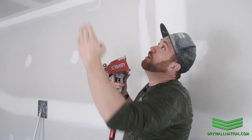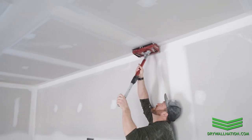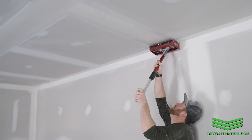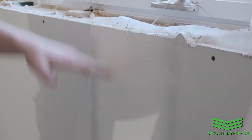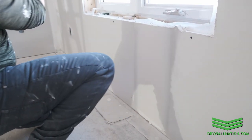Here's an example of what I was just talking about — there's a dust pocket right in the mud there. That's the dust being trapped between the mud and the joint, caused from pre-sanding. There's a little bit of dust on the surface. Now if I only passed over that once, when that dries and I come to final sand, that's going to flake off and you're going to have imperfections in your mud. So that's one of the importances of passing over your seam twice. I'm going to finish this off and now you can see the dust pocket is there — when I go over it a second time it's going to get rid of that little dust pocket. See, and now it's gone. I just did that seam once — you can see there's a little bit of dust trapped right there. If I go over it a second time it gets rid of that.